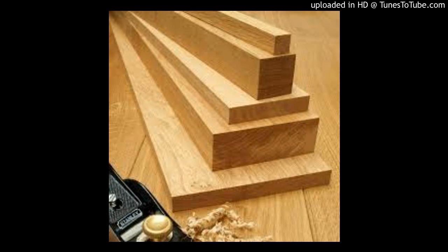In a case like this, where the handrail posts are fitting between the double bearers, yes, it would matter, because then the handrails would be different modules and it would look strange. So there, the posts would govern the design. In this particular case, there was no attempt to fit the handrail posts on top of the posts in the ground. No, it didn't matter there. That's how we attach our handrail post. Very, very simple. Bolts over the joist either way.